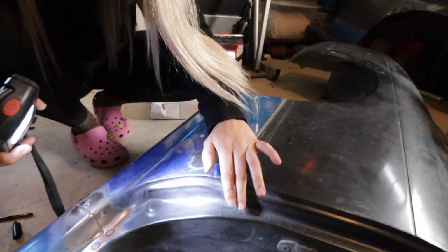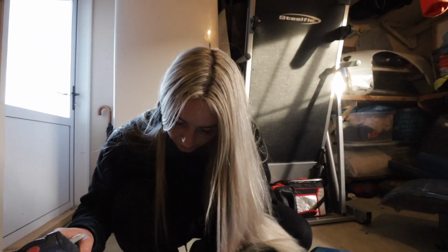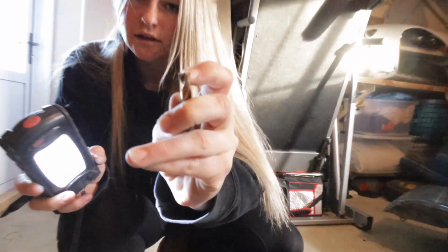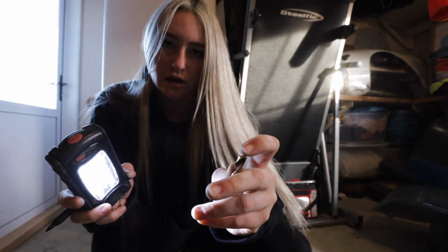Than some of the other ones. But I hope that kind of makes sense as to what we're trying to drill out. So the little spot weld drill bits have a locating pin in the center, and then they bite on either side. So the locating pin kind of goes blunt, and then the edges kind of go blunt, and that's what I'm struggling with a little bit now.